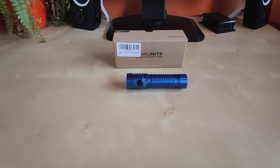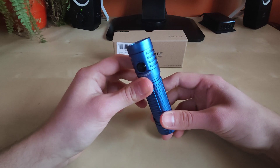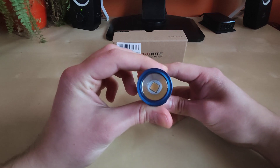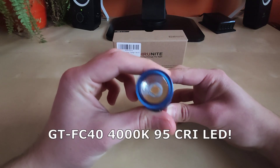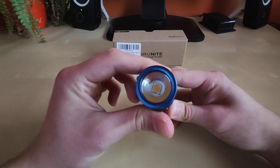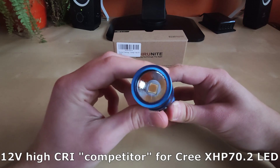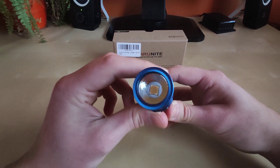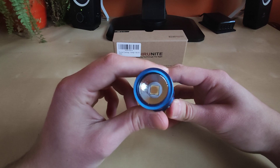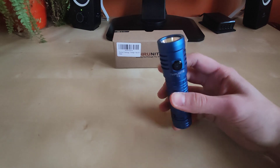This one actually features the not-yet-popular but already becoming known Chinese GTFC40 LED, which is known for a 12-volt neutral white ultra-high CRI output. This is a high CRI alternative for the XHP70.2 LED, but beware — it has to be in a 12-volt configuration, and luckily the Thrunite T2 does have a 12-volt driver.